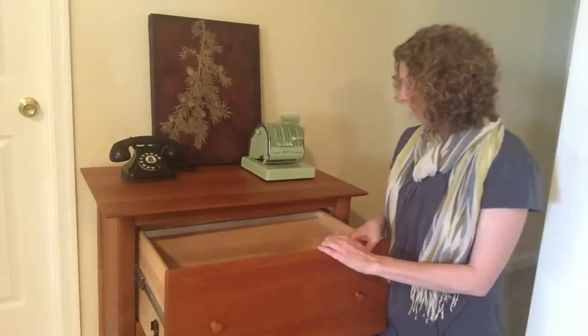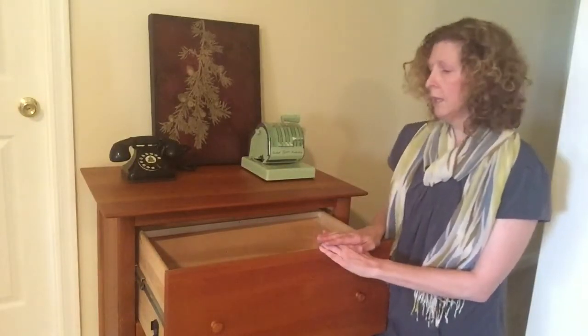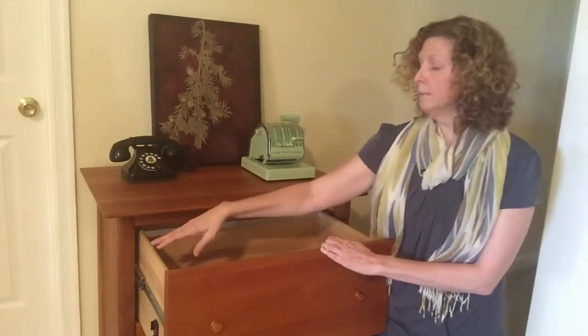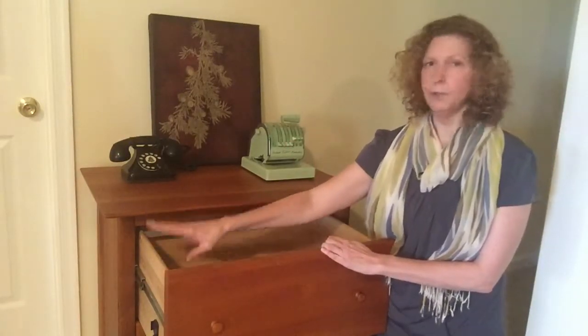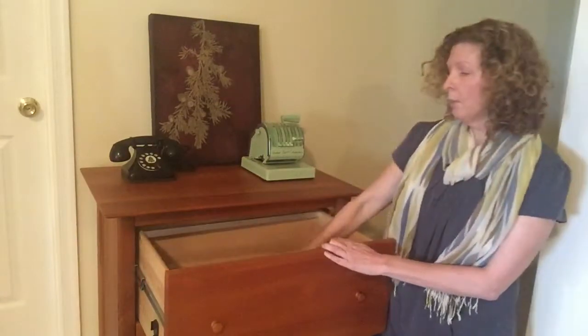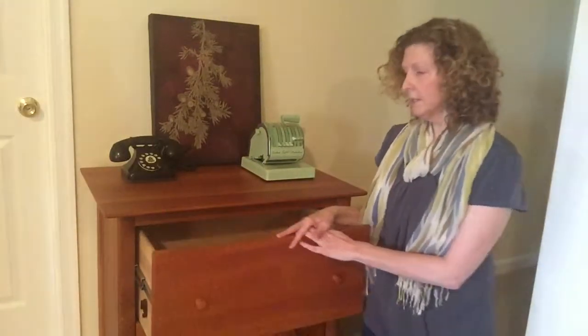What I don't like about this in a bedroom setting is two things. One is just visual. Particularly in a bedroom, it's something you use every day, your master suite is a more elegant part of your home. When you invest in nice hardwood furniture and you have the nice solid wood drawer box, I just think seeing the glide is not as attractive. The other thing I'm concerned about with the side glide for a bedroom is that you could catch your clothes on it and maybe rip them. So while I don't mind it for office furniture, because it is sturdy and has a smooth operation that people like, I just really prefer the undermount that's hidden.